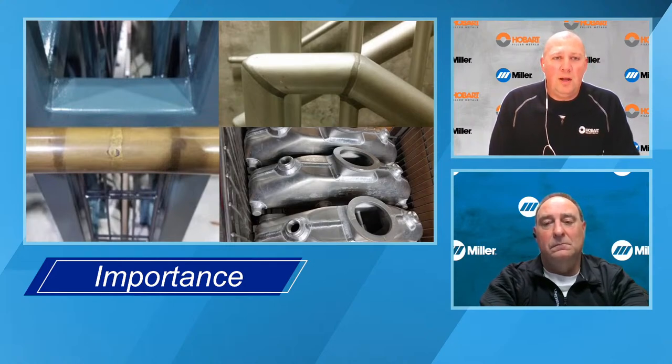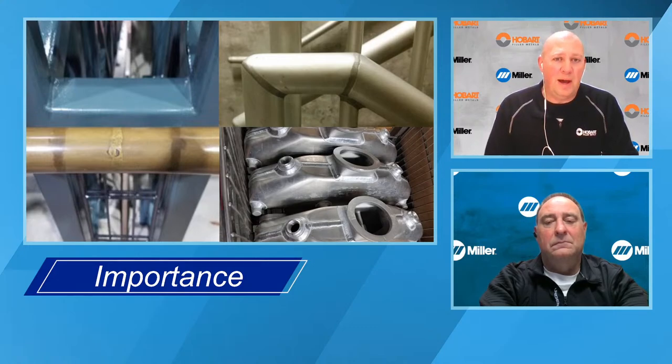So if you want to make that oxide thicker very quickly, you can do an anodizing. I think they use sulfuric acid and they put it in a bath where they apply a certain voltage and current to it, and it forces that aluminum oxide to grow very thick very quickly. So now you have a very hard surface. And then some other reasons would be if you wanted to change the color of it. So sometimes if you don't want to paint aluminum, you can anodize it and dye it black or whatever color you want. So usually hardness and or changing the color of it are the two reasons why you would anodize.